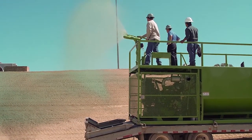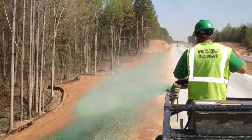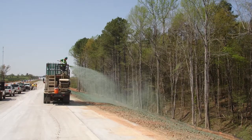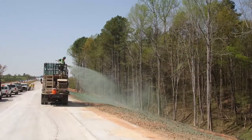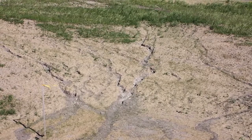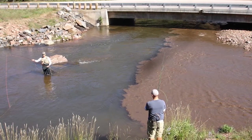The last decision is to select the proper hydraulically applied erosion control product to assure soil stays in place and has the longevity and moisture holding properties to establish the vegetation. If the proper products are not selected, failures can result, vegetation will not establish, and soil loss and contaminants can enter our streams and waterways.